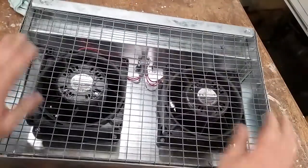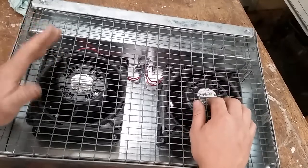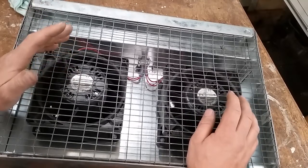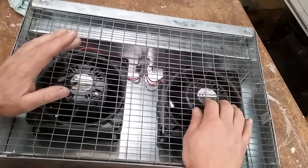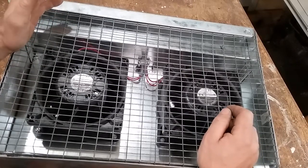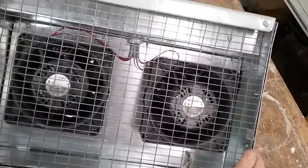Now the fans — the fans on these are just little old biscuit blowers. I've got a supplier on these here in town. They do a lot of commercial industrial panel building, control circuitry and stuff like that for weird industrial plants. Years ago they ordered a skid of these little biscuit blowers and they got the wrong thing in. So they're selling these for like 20 or 30 bucks a pop, which is really cool. I think these things push like 250 or maybe even 500 CFM per blower — they push an amazing amount of air. That's what I use for the blowers.